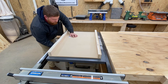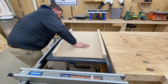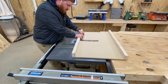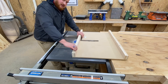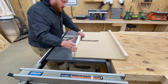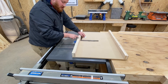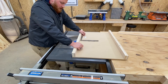Keep your hand out of the way. After you've made your cut, we're going to put our square on here just to make sure that the blade is square to the fence. Some of you might argue that it's too late to check this — it's actually not, because if this is off, you could take these fences off, trim up the edges, whatever you need to do to make it square. In my case, it is perfectly square — we're good to go. So now I'm going to take the sled off, raise the blade up about an inch and a half, leaving about three-quarters of an inch between the top of this fence and the top of my blade. You don't want to cut all the way through this because then your whole fence will be cut in half.